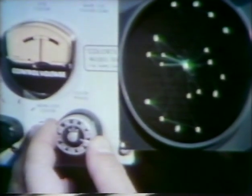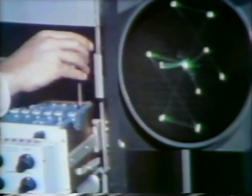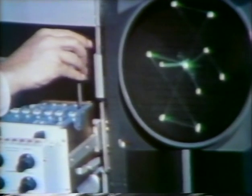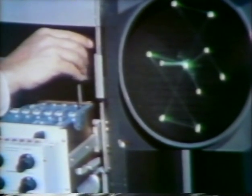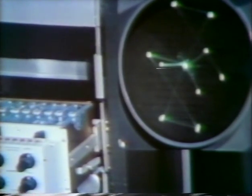With the recorder in playback, adjust the color phase control on the Colortech front panel so that the colors from the VR2000 output on the A-channel are superimposed on the local bars on the B-channel. Check burst phase, and if not correct, pull out the proc amp chassis and adjust DL1 on board 19 to place burst in the correct position — that is, superimposed on input burst.